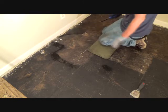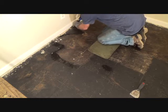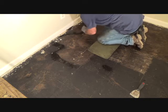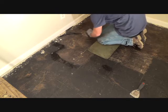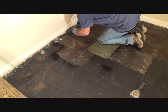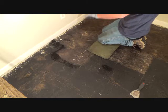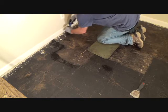When you spray the cleaner on there it's going to loosen that up more so than if you didn't leave this top layer on. It looks kind of easy but you get down on the floor and try it and you're going to be like, 'Oh man, I've got to do this whole room or the whole hallway.' Maybe you're taking out the backing of linoleum in your bathroom to replace it with something else — you could use a razor scraper for that too.